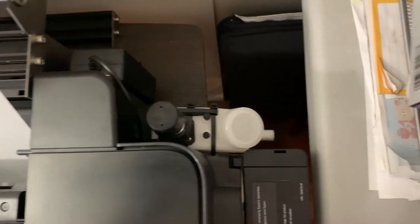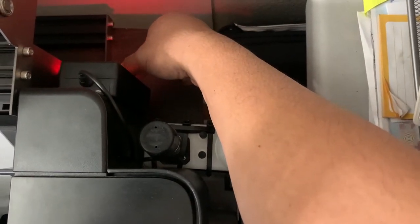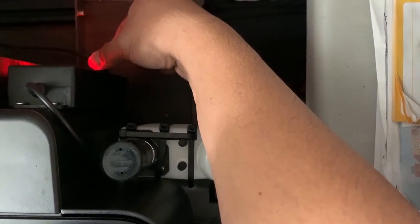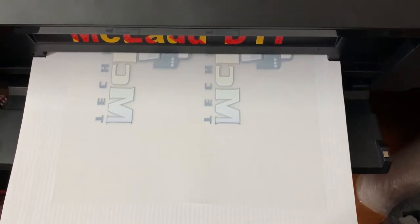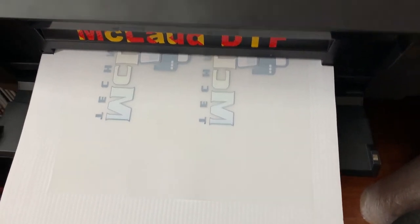We have a control here so you can turn on the ink stirrer and it starts stirring. You can change the speed with the knob — you can hear it becomes faster or slower. While printing, I'm stirring the ink so that I produce very good white, and it also helps prevent clogging the print head, because white ink settles.